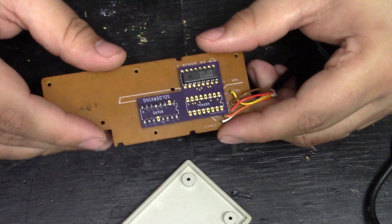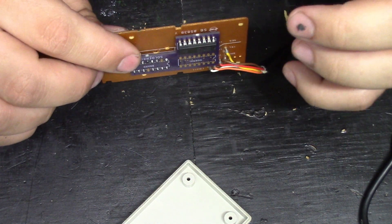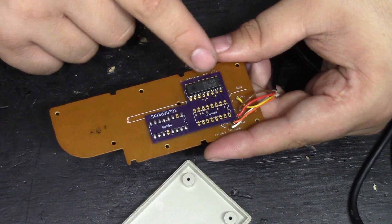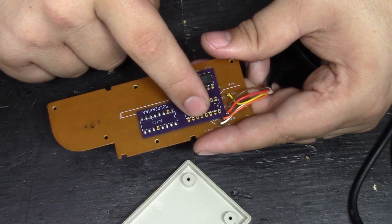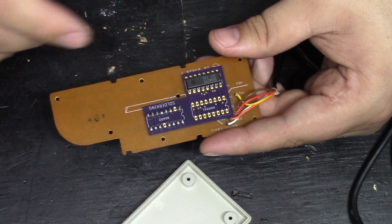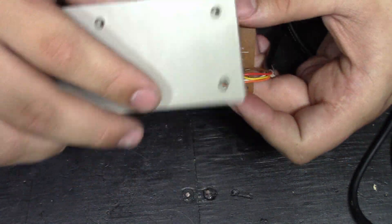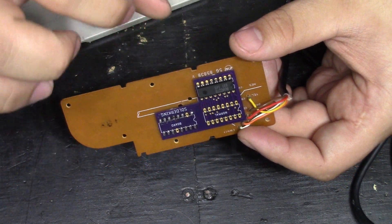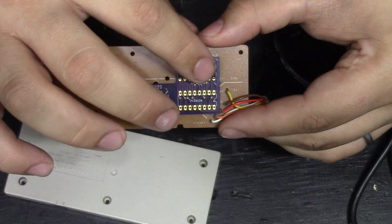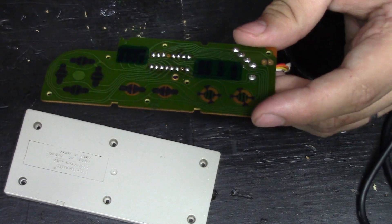If we take a look at the first prototype of this board, you'll see that I installed it on the back — the reason was just because it would be easier to install, but that added height doesn't allow for the shell to close perfectly. This was the first design, and my first idea was to have it an end-all be-all: you can have the mirrored version of the control scheme with this chip, or take the chip out and put it in the normal position to allow the controller to work normally — eliminating the need for switches or two circuit boards. This would be accomplished using IC sockets instead of soldering the chip in. But with just the chip in, we reach a height that impacts how the controller closes, and adding an IC socket would further increase that height — the plastic would bow and it would be noticeable. So I decided to skip this idea and go with the two boards showcased in this video. Again, that is all for this video. Thank you so much for watching. Check out my Instagram for those giveaways, and I will see you next time.